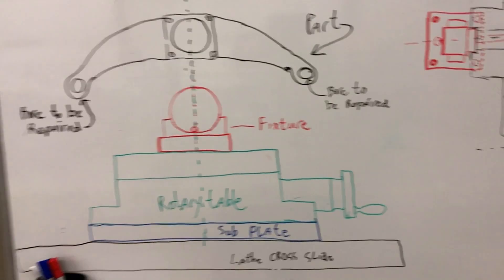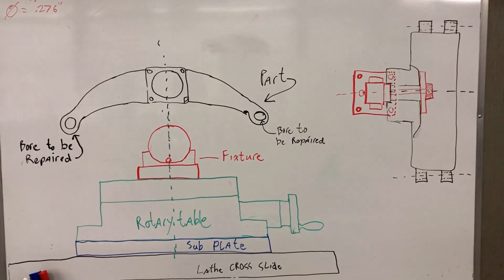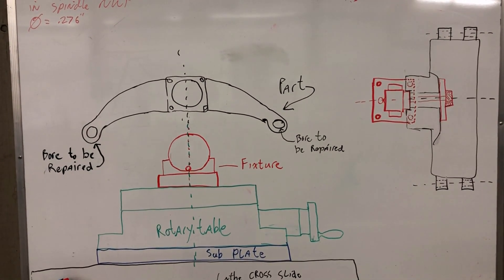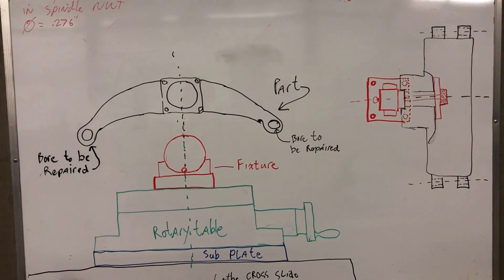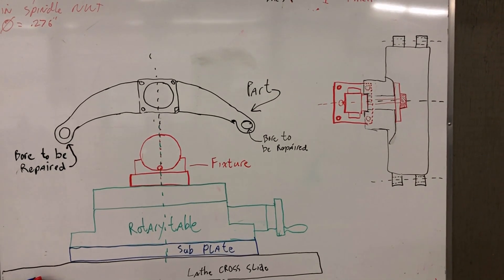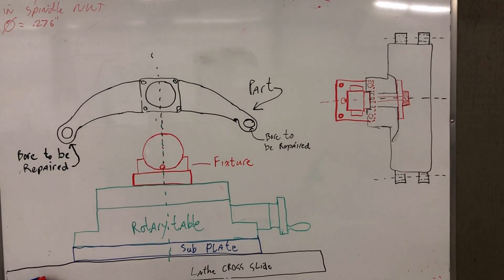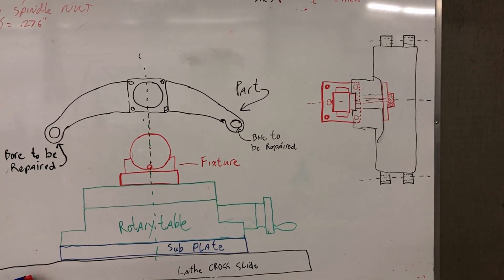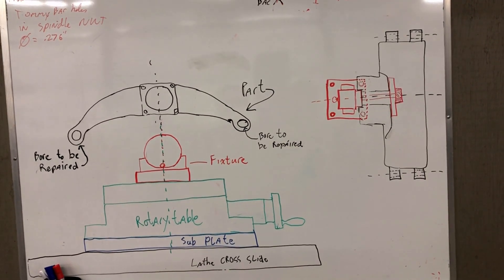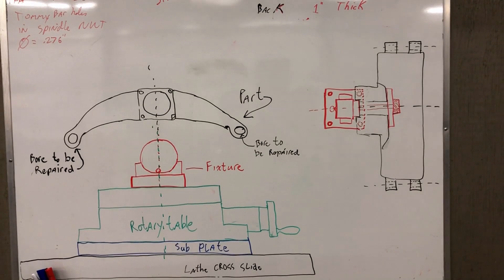So that was the setup — I did a dozen parts. At that time I didn't fully trust my ability to bore the holes to exactly the right size for a press fit by moving the tool outward with a dial indicator, so I had a reamer ground down to the size I needed. I would rough the holes to size with the line boring bar, then ream them to the final size to fit the press fit for the bushing, and it worked out well. I wish I had video of it, but I didn't take video back in those days 15 years ago. Anyway, thanks for watching.